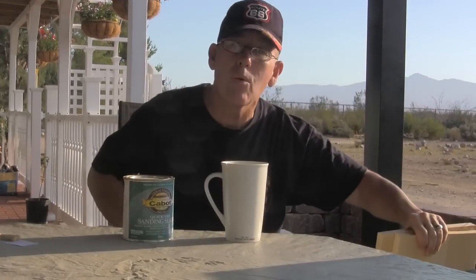Remember, why are we using the sanding sealer? We're using the sanding sealer so the ink or the black won't soak into the board when you're doing your layout, or after your carving when you're putting your black on there. So you have to put the sanding sealer on before anything else. I suggest, as soon as you get it back to your shop, get that sanding sealer on there and put it up in the rack for future signs. That's when you need to put your sanding sealer on. You don't put your sanding sealer on after you've done your carving, because that's when you actually want the ink or the paint to go into your carving and stay there. So sanding sealer goes on first before anything else.